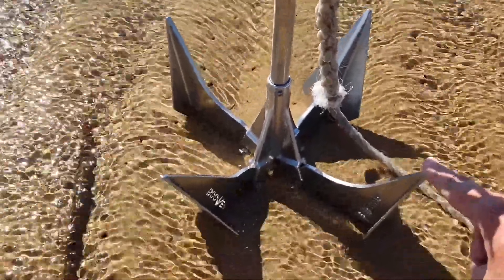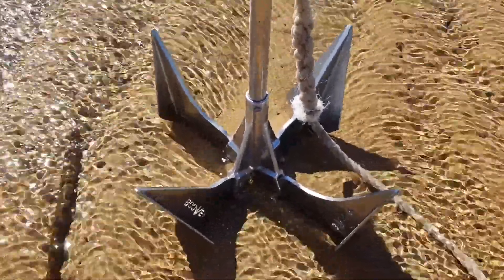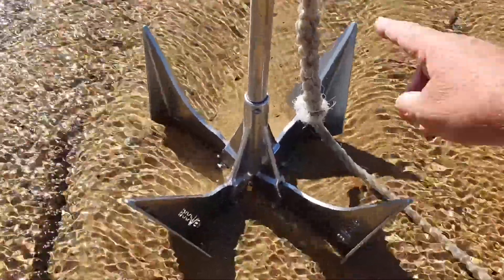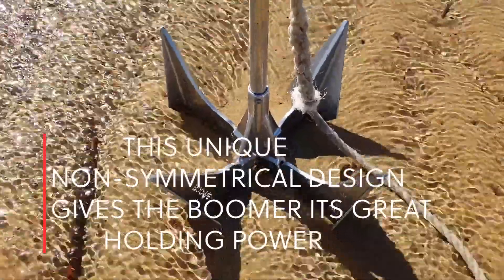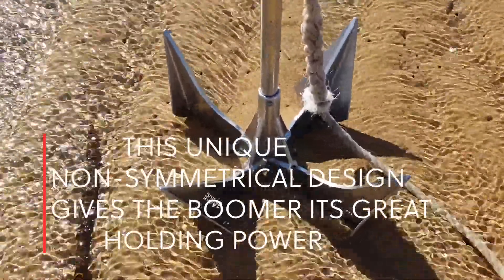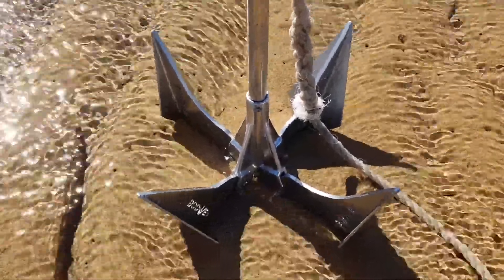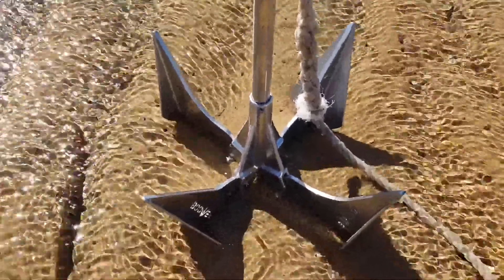What we've found is if they're fighting against each other, two prongs trying to dig down into the sand or mud has very, very little holding capability. But as soon as one prong promotes itself down, and the other two prongs on the outside become like big brakes, the holding capability really goes way higher than you would actually imagine. The interesting thing is that because these points have different penetration qualities, this anchor actually chooses which point will penetrate dependent on the softness of the material it's trying to dig into.